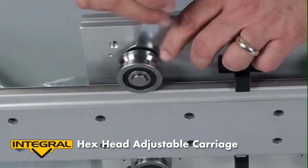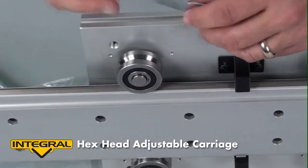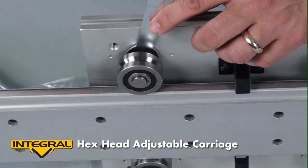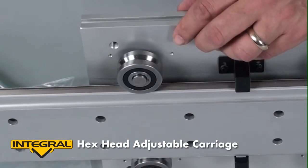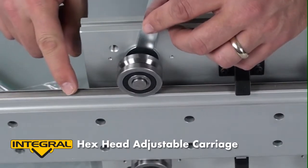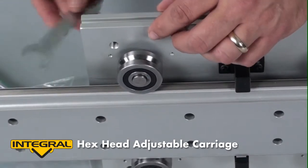It's important — don't try to torque with this wrench here. It is not that sturdy; it is designed only to hold the nut. You will bend it if you try to torque on it too hard. You don't need to torque hard with this wrench. You're just using this to load the roller up against the rail. If your preload is too high, you'll have much shorter product life and you'll wear the rail.